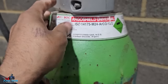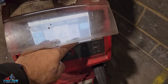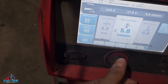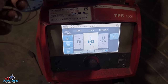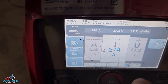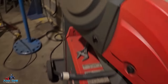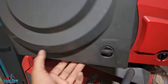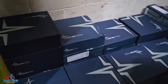It's going to be a MIG machine of course — my Fronius TPS 400i. All my roots are going to be run on this root setting here. If I'm going to be capping, it's going to be around 244 amps. The gas is 12% CO2 basically.